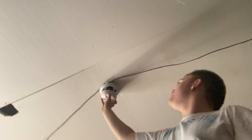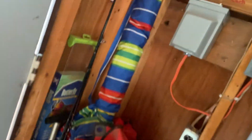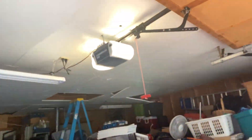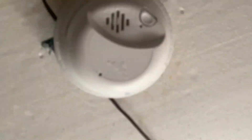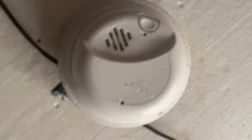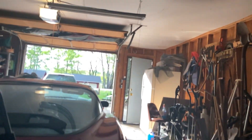We plug in our smoke alarm. Then go over and switch on AC power. You can see the garage door light turns back on and we get a green power indicator. Press the button — beep, beep, beep, beep. If it works and it's interconnecting with other smoke alarms like it should, you'll be all good to go. Don't forget, get some smoke spray and test out your smoke alarm.